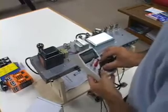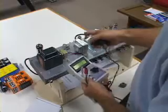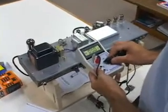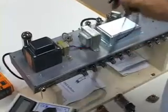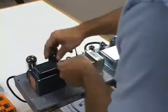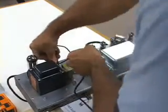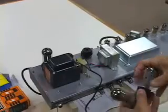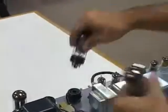Next, you get your Tad Bias Master. It's a pretty simple device. It's got four inputs — we're only going to use two of them because we've only got two output tubes — and this switch switches between each one of them or to off. You've got to install these two sockets first. Same deal here: you've got a keyway on the bottom that needs to line up. Rock it in, and then put your tubes back in, or the new set of tubes if you've got an old set that you're replacing.